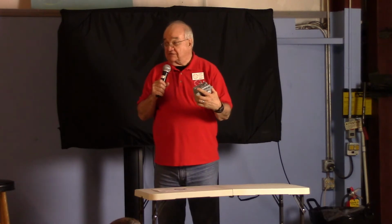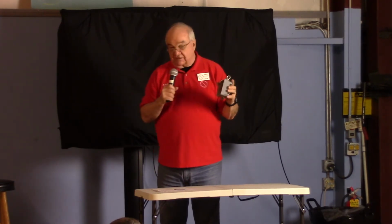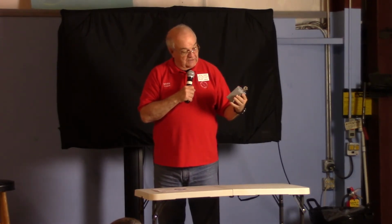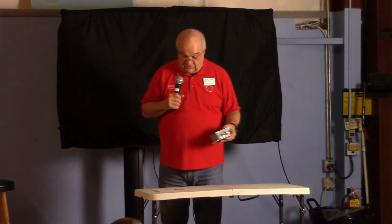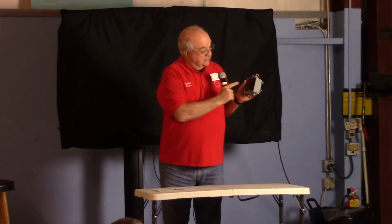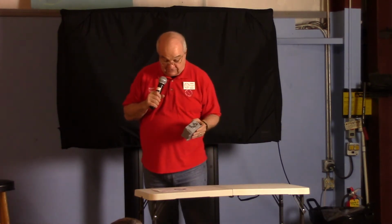So you're on HF with just a very easy HF antenna setup. The wing nut is to connect to a ground rod, which is right next to, underneath the interface or transformer. They call it a 49-to-1 ratio transformer. The primary has 2 turns, and the secondary has 14 turns.